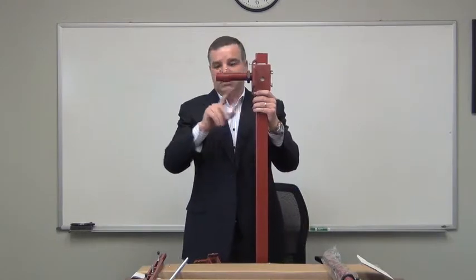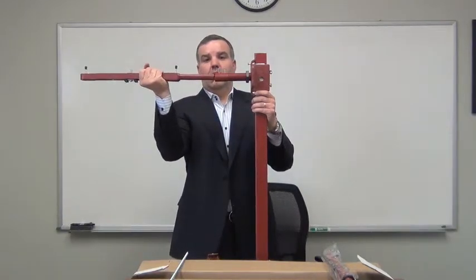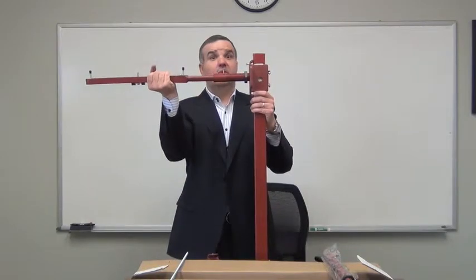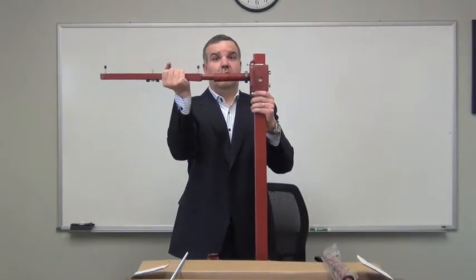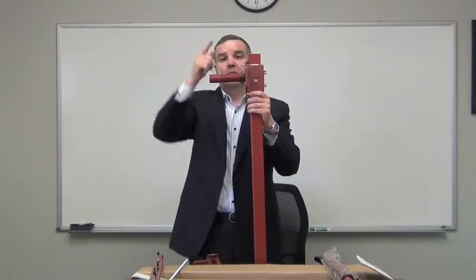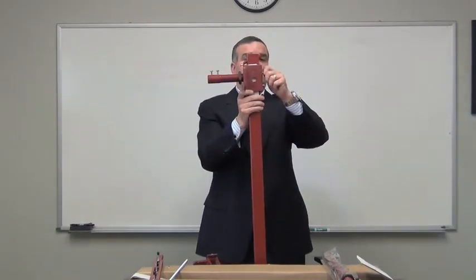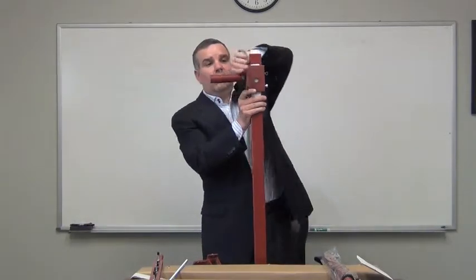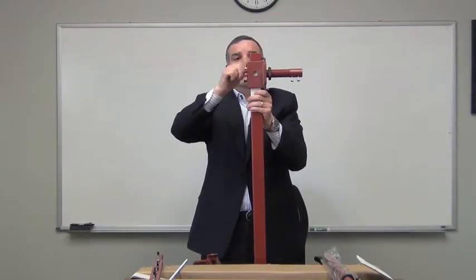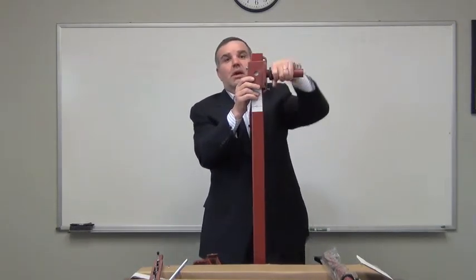So the power of this is when we put the arm into the nipple, there's adjustment in the arm. So we have one stage of adjustment here relative to the length of the fixture that we're serving. We have another adjustment in the nipple. We can thread the nipple into the header bracket all this distance of the thread. The third adjustment is we can simply invert the header bracket like so, picking up 2 inches, and do everything from the other side.